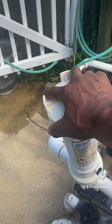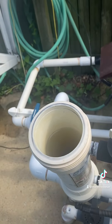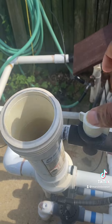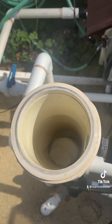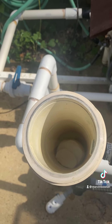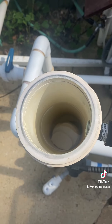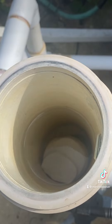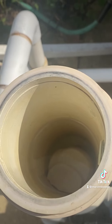So I just cut off the system — it was pressurized. And you should hear that noise when you open it, but that's actually coming from the control valve, which controls the flow of water through the system. If the check valve were working properly, the water should at some point drain quickly from the system instead of this very slow rate that it's moving out. Basically those tablets have been there all week and they should only last a couple days. It's going down slowly, but you should see the check valve open and the water drain out quickly after the pressure drops.